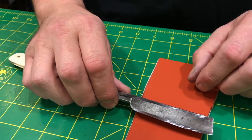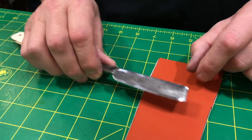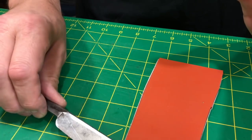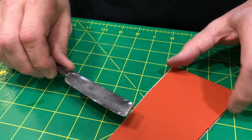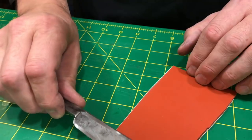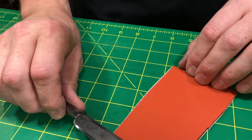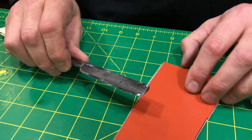The other part is, you don't want to gouge the stone. You don't want to belly it, or wear it where it's lower here than there. Yes, this has now become my 1K. So you want to keep it as flat through wear as possible. I routinely pull my stone off the bench and then put it on a diamond plate to resurface it while I'm honing.